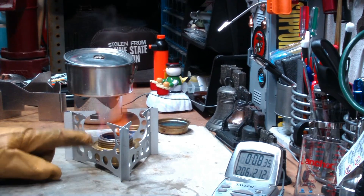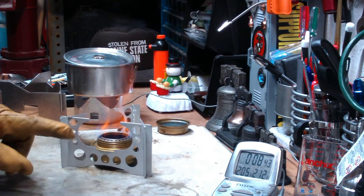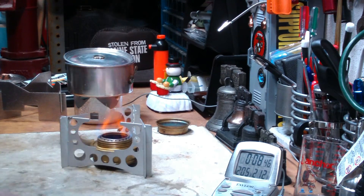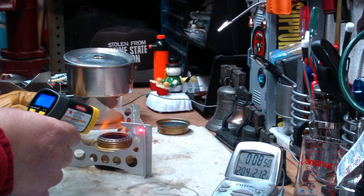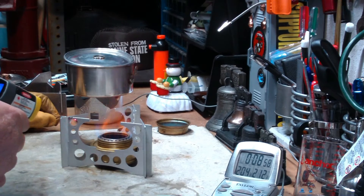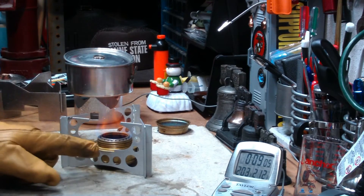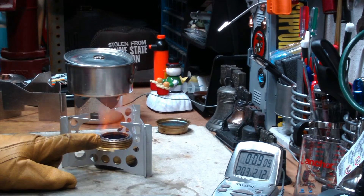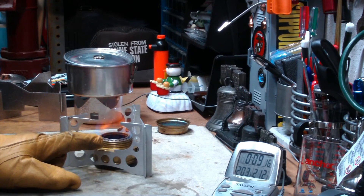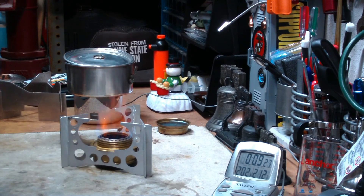If you saw on the second camera, the flames were coming up and they weren't touching the legs — not even when it was hitting the pot and coming across. So the pot stand is not acting like a big heat sink. I do wonder what would happen if the burner was elevated a little bit. The distance from the top of the burner to the bottom of the pot is 1 and 5/16 of an inch — that's 5/16 more than the 1-inch sweet spot. I wonder what would happen if I elevated the burner up a little bit and tried the same test again sometime.